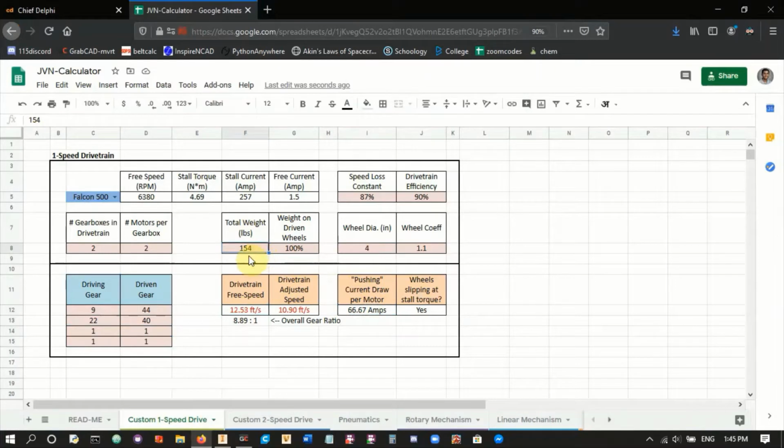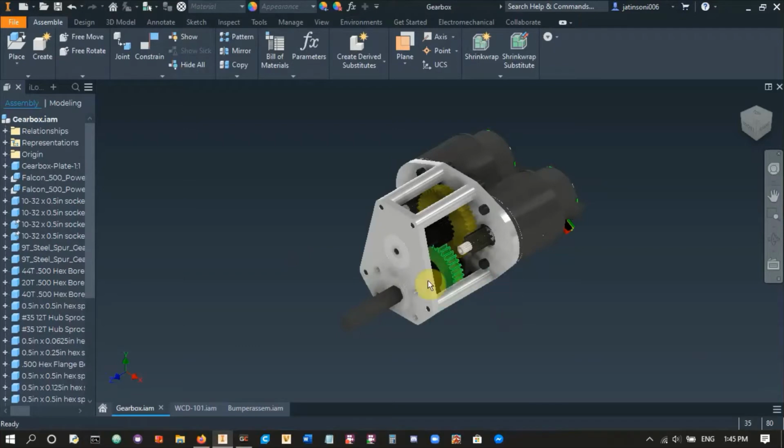What we can do now is say, whoever is doing the CAD challenge, when you make your own gearbox, try making it with 6-inch wheels, so that changes things up. Now you have to think about how to make sure you don't pull too much current and you're going the right speed. Using a different robot weight, potentially a lighter robot, mixes things up. So we're going to add those restrictions so that you can go off of them and think about your gearbox or whatever the CAD challenge is on your own, and not just do what the video did. It's important to learn how to make these specific parts, but it's even more important to learn how they're designed and how you make the decisions around them.